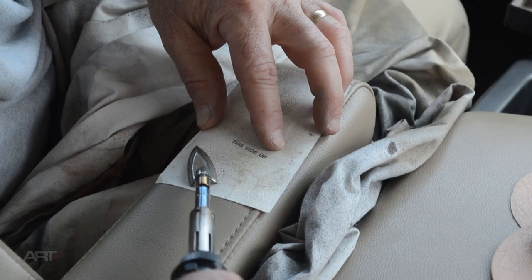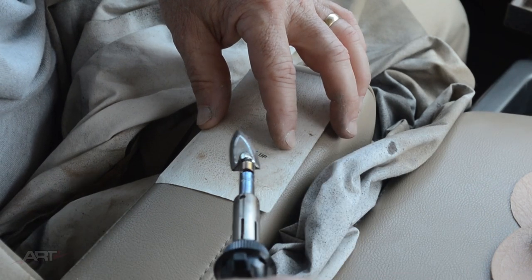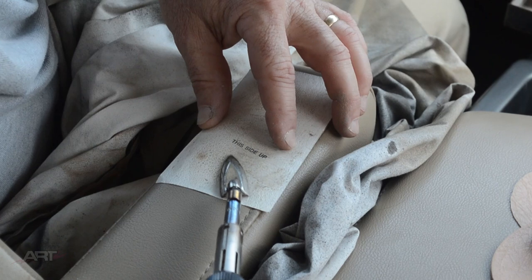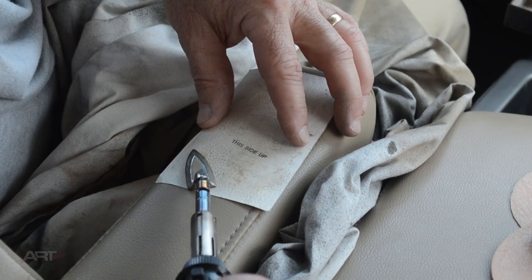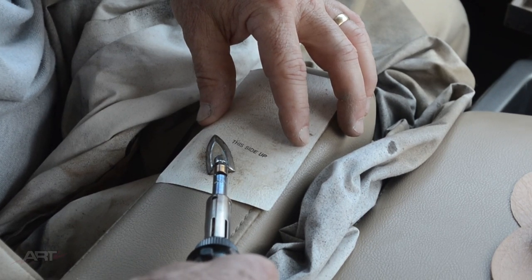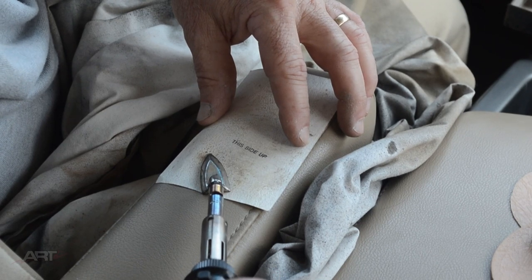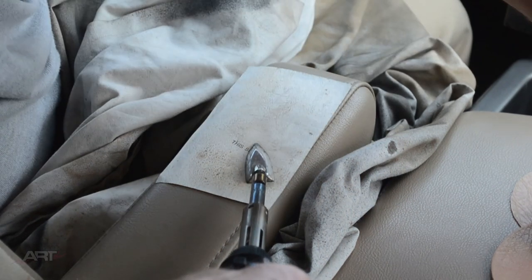Because the iron was at full tilt, it's a bit too hot for the paper, so I'm turning it down to medium. At this point I usually spritz it with water to cool it down, but in lieu of that, I'm keeping it in motion on the paper so we don't have too much heat concentrated in one area until the heat is dissipated. Then we can let it sit on the paper for a bit of dwell time so it penetrates down through the vinyl compound. Now I'm setting the chill bar on what I just cured, and as I cure the next section, I'm moving the chill bar forward and using it as a guide.